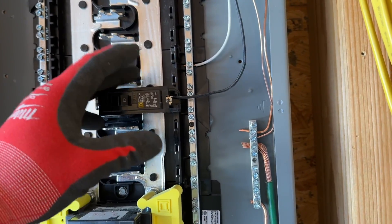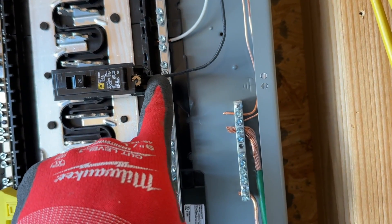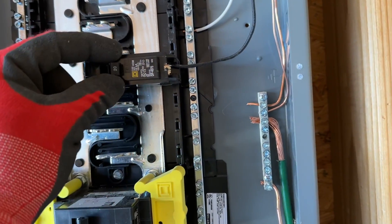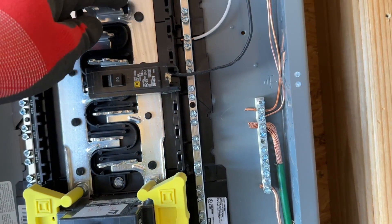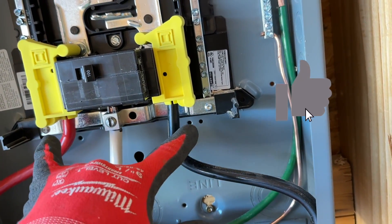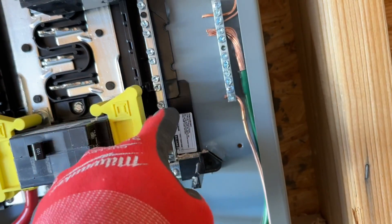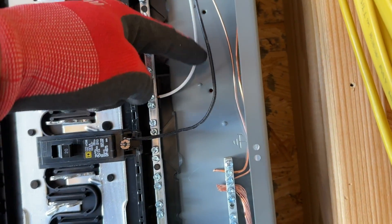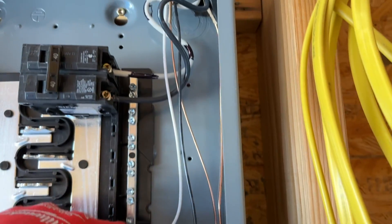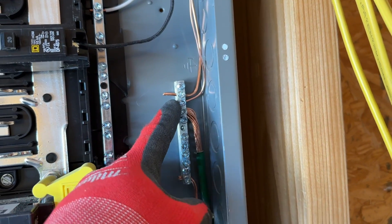And that is just the basics of how we wire in a circuit. This is a 20-amp breaker. We have our hot wire on the back of the breaker and we've rocked it in to the bar. These are live bars — hot, fed by these two hot lines. So the red and the black are both hot. Our neutral is tied into the neutral bar — that's where our white line goes. And you can see coming out of our casing, we have our ground going over here to the ground bar.